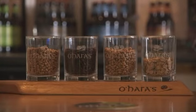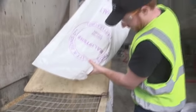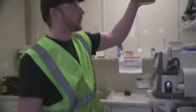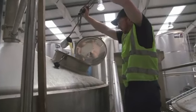The first stage of the brewing process is to mix the malt with water, and what you're doing there is breaking down the starch that's in the malt into more simple fermentable sugars, which happens naturally from enzymes that are actually already in the malt. The mashing stage typically takes us about three hours to go through.